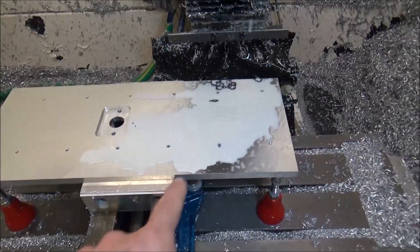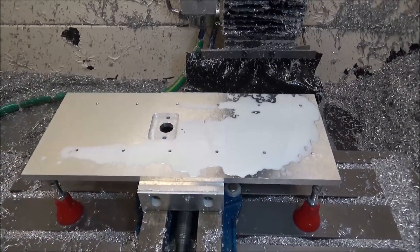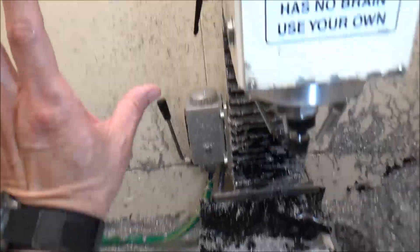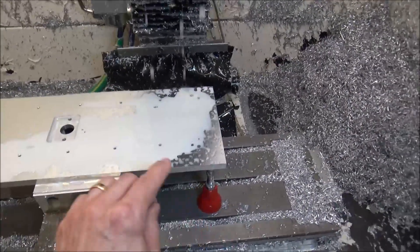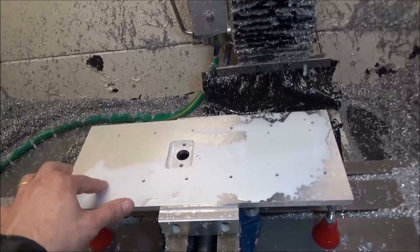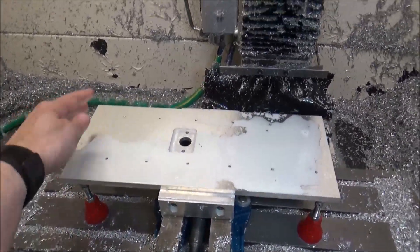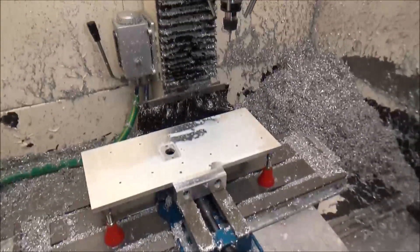All right, that finishes up. We've got our mounting holes here for our rail, and then this pocket here for the bracket for the air cylinder. There's going to be some other fixtures, some sensors I need to mount, and some holes for maybe some cable chain. There may be some other mounting holes for the bracketry to hold it onto the actual mill, and once I get all that sorted out I'll drill those holes manually. You can see I used machinist jacks here to keep it supported — this is a long piece and I wanted to make sure, even though I wasn't doing much but drilling and thread milling, I didn't want anything to move or deflect. So I put machinist jacks under here to support it — there's four of them, just to give it some support. Let's take it out and get a good look at it.